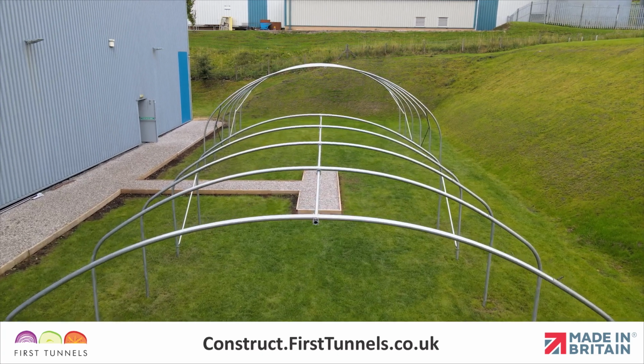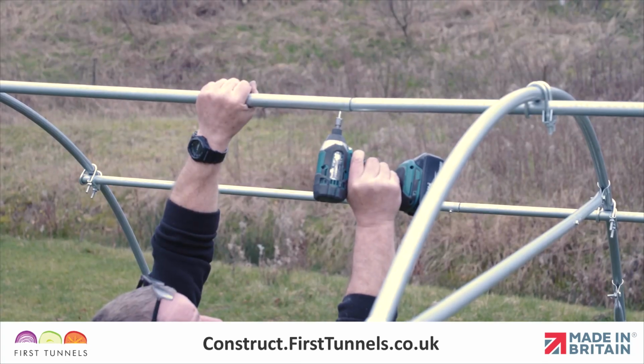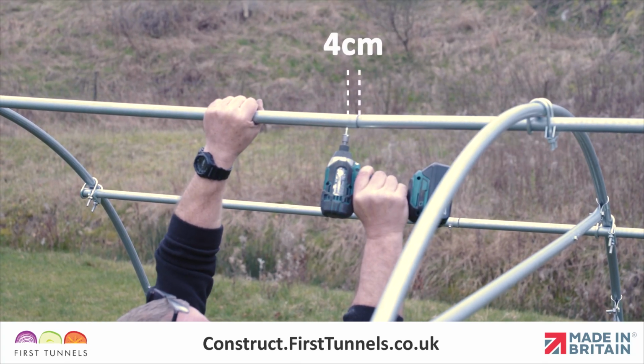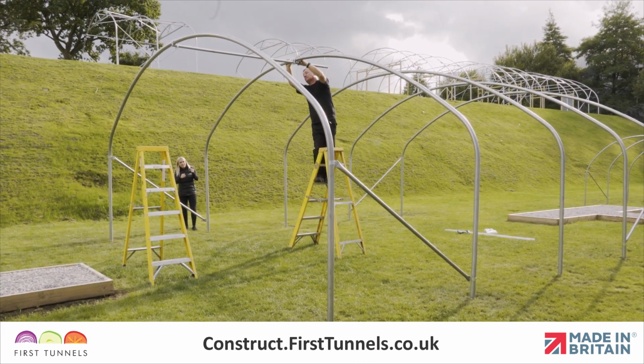Work along, adding sections of ridge tube and securing to the hoops using ridge clamps. Secure the two tubes together using a self-drilling screw 4 cm from the joint. Ensure that all intermediate hoops are vertical and tighten the ridge clamp.